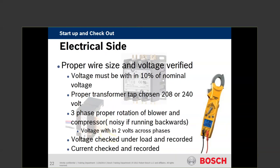On three-phase — not found on residential but in commercial — phase rotation matters. If you ever hear a scroll compressor run backwards it's pretty noisy; if you see a fan running backwards it's obvious. The squirrel cage should blow in the direction of the curved blades; if backwards it acts like an exhaust fan. Typically you just change the wires at the disconnect — you do not want to go in and change a fan motor lead when the compressor and other motors will also run backwards. Always do it at the disconnect. Your voltages should be within 2 volts: if A-to-B is 240, B-to-C is 240, but A-to-C is 230, that's a utility call. Always check voltage under load and record it — that is your baseline.